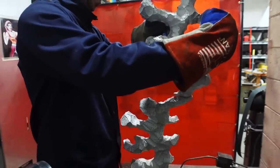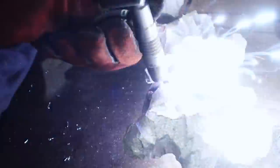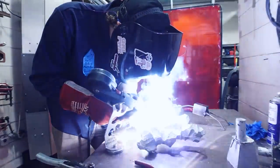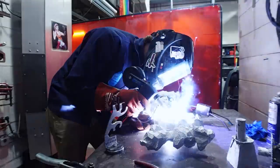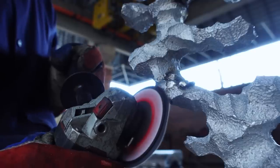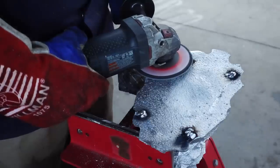That's the base to the second piece, and here's the top piece. First you just tack it together so it's held in one place, and then you can go around doing more thorough welds. There are also some areas where there was some shrinkage — as the metal cooled in the mold it shrank, which created cracks — so I went back and welded inside those cracks to fill them back in. All my welds I then go back over with flap discs, hit it again with the die grinder, then hit it again with the needle scaler, just to blend it all together so the welds aren't so apparent. I also put four little welds on the bottom of the sculpture as feet.